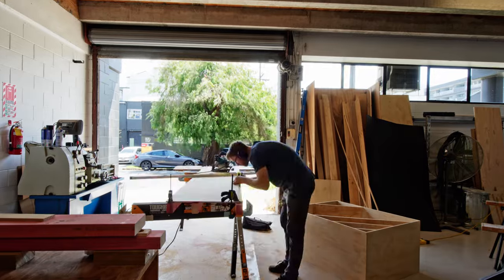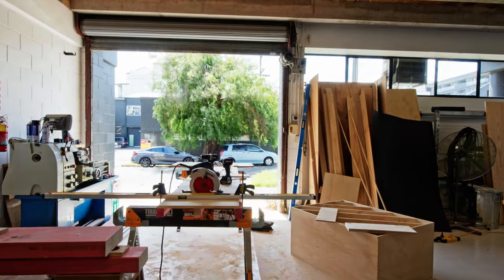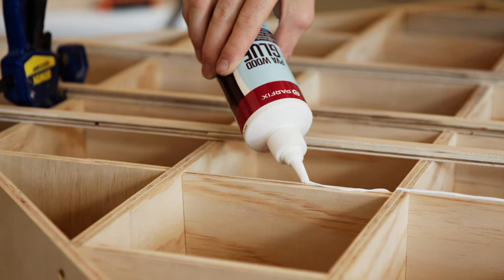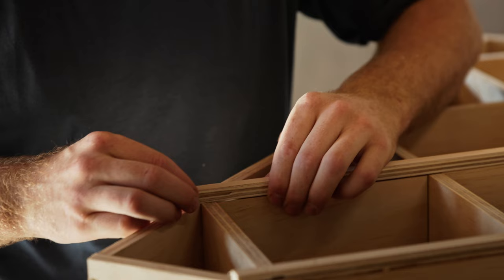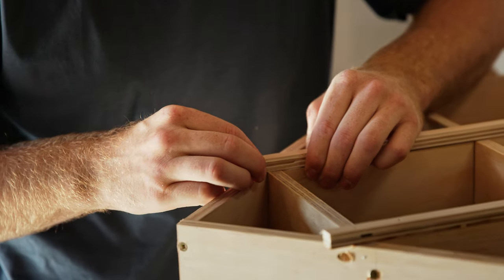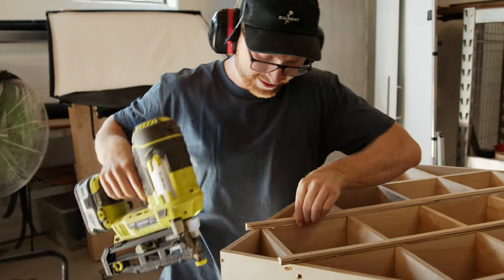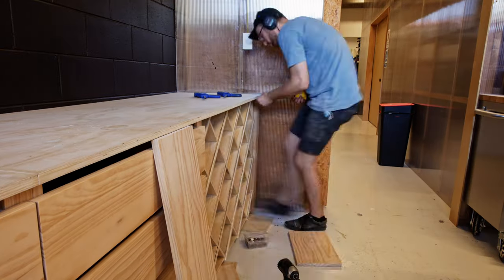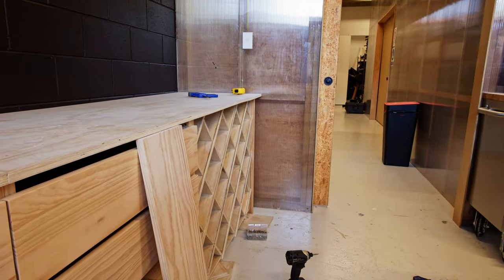It's going to make our lives a lot harder but it's going to look a lot better. The rack should stop tripods bumping into each other like they would on a regular shelf. After cutting the long continuous sections I added shorter joiners to form the lattice. For connecting everything together it ended up being strong enough to glue and brad a strip along the edge, then we added a screw from each side. We finished it off by screwing it into the bench top and upright and added a pine frame to the front.